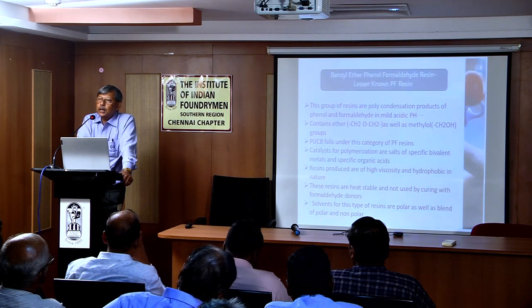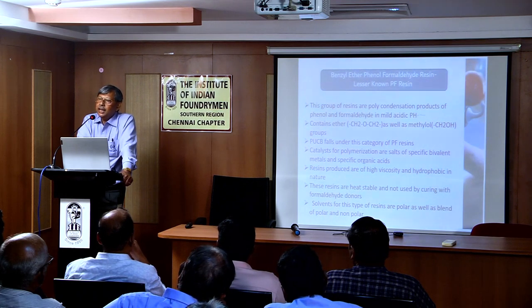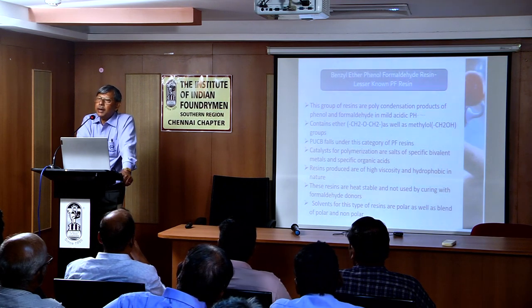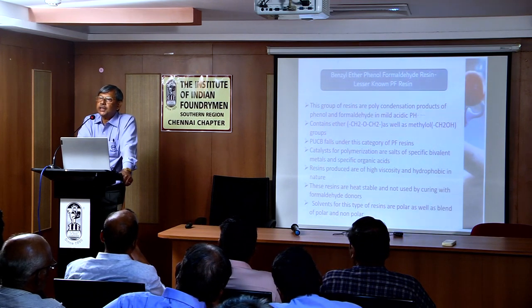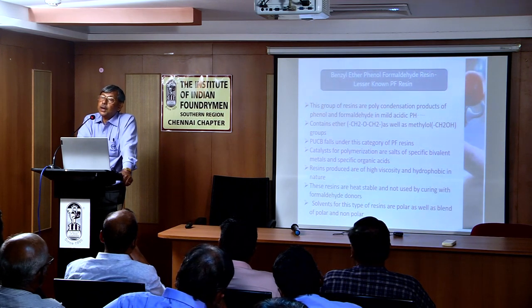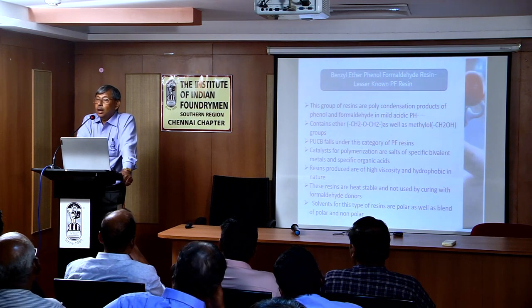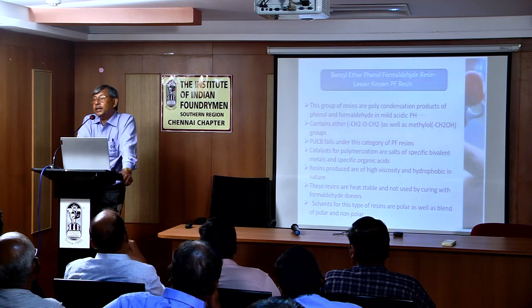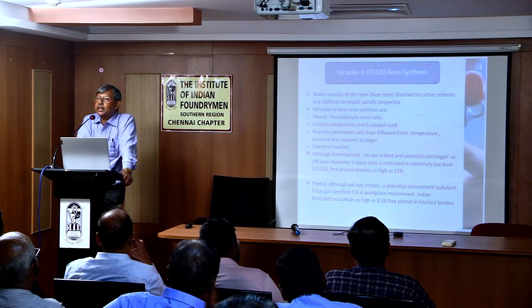It is cured at room temperature with the help of isocyanates, and the reaction is triggered by amine, triethylamine in our country. Solvents for this type of resin are complex. A polar and non-polar blend of solvents is used. Polar solvents are ketones and esters of high boiling point. Why high boiling point? Low boiling esters and ketones give quick evaporation, and you will not get the bench life of the mixed sand.